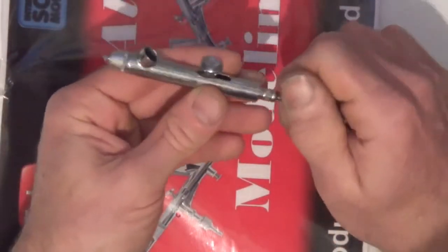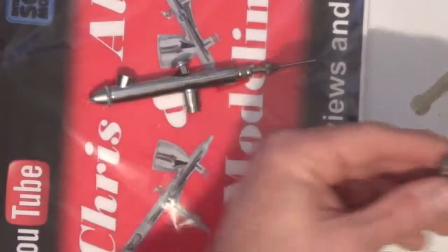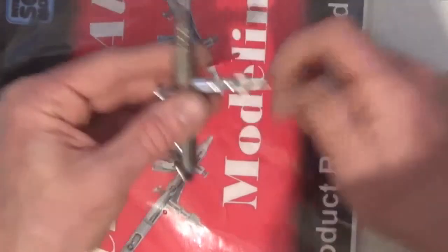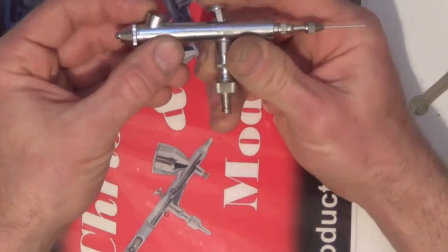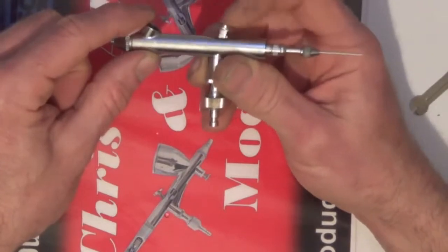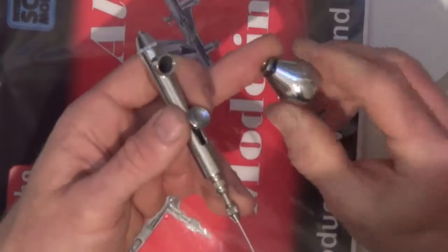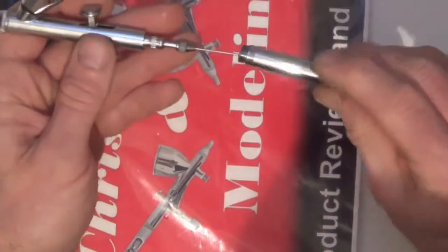Put the correct original needle back in. Pinch it up just a fraction, not a lot. Screw this out and hopefully that Teflon tape sealed it. Push that forward. Put a bit of lube on this O-ring here because it's a pain for sticking — another problem with this one. This one also had a supposed Teflon one but not convinced. Working — you can tell if it comes back and it sticks that you've tightened it too tight. But that's absolutely perfect.